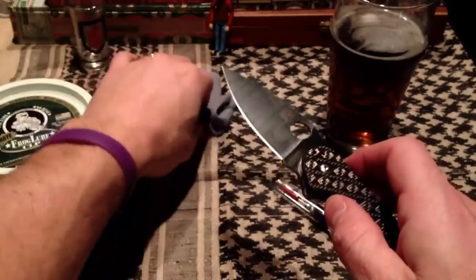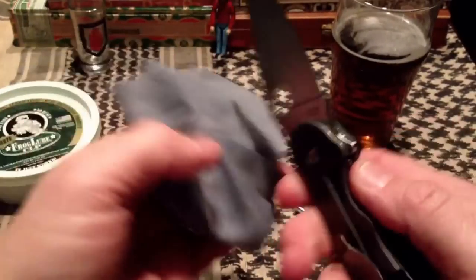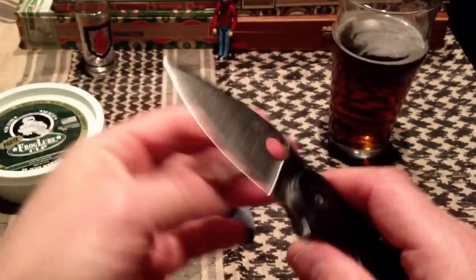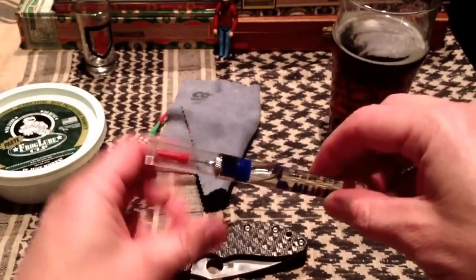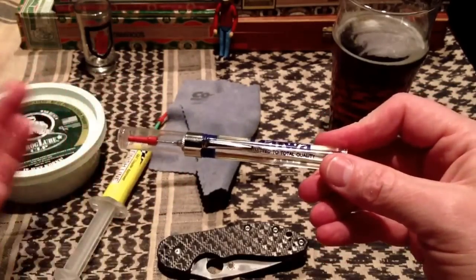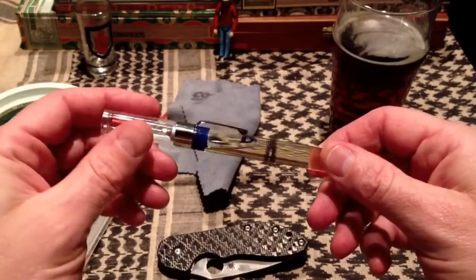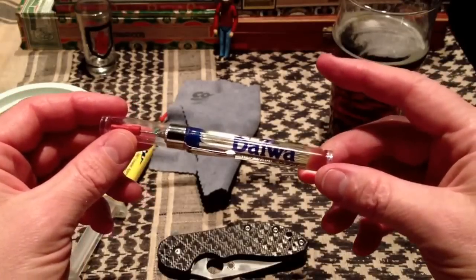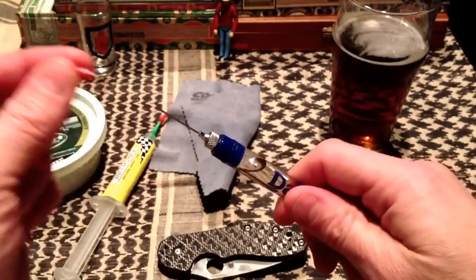For pivots and whatnot, I can see this one's looking pretty nasty — let's go ahead and give it the treatment anyway. You can see I've been EDCing this blade a lot, although this week I did EDC my new Civenza. But the Domino has definitely been my pocket jockey for the last month or so. For pivots, I traditionally used mineral oil because I like to use my knives in the kitchen and want it to be food safe. But once I discovered the Daiwa oil, I wanted to get away from mineral oil because it really collects a lot of crud and draws pocket lint into your pivot. So I searched out this Daiwa oil — it's actually a reel oil for fishing reels, and it comes with a needle applicator tip like you see on nano lube and whatnot.